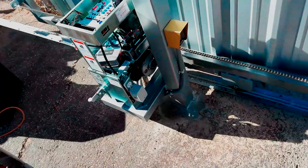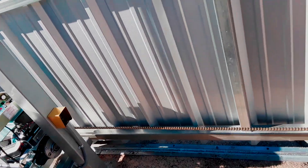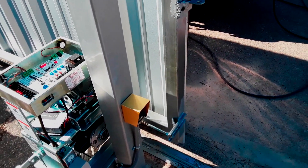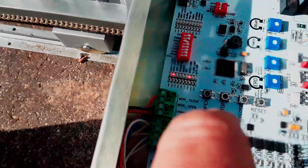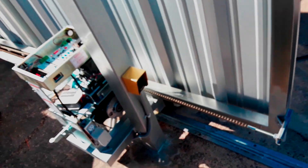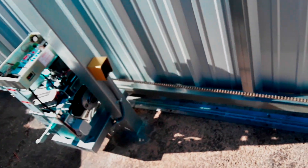We'll go ahead and click it again — give it an open command. We've got the gate operator opening. We want to check the safety device while the gate operator's opening to make sure that we have the direction set properly. In this case, we do — we have it set open-left, and it is an open-left gate. That's something to be cautious of because if you have multiple safety devices and you test it in one direction, it may work just fine, but in the other direction it could do an action you don't want. So we're going to let it run now that we know it hits the stop limit before hitting the catch.